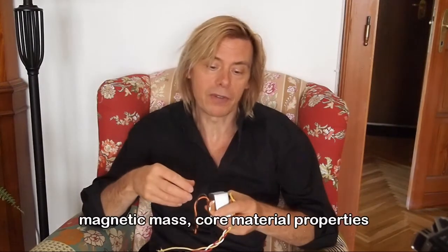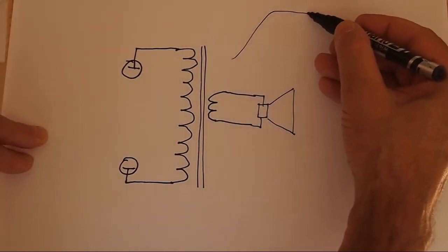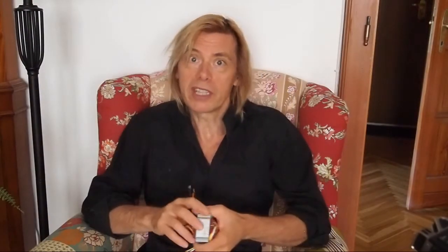The coupling isn't perfect — the frequency response of the output transformer has limitations. The low frequencies are restricted by the mass of the core, the amount of iron. The high frequency response is limited by parasitic capacitance between the coils. Low frequency is an issue because manufacturers are always trading off cost for performance. To get down to 20 Hz you'd need a lot of iron, but for guitar we don't care about 20 Hz — 80 Hz is a low E. Typically the low frequency might roll off at around 60 Hz, and those parasitic capacitances won't kick in until 10 to 12 kHz, which is far beyond what we care about for electric guitar.